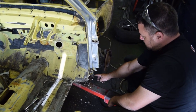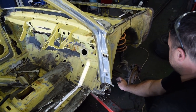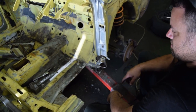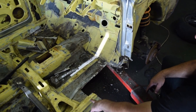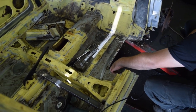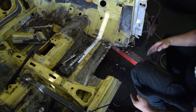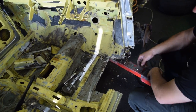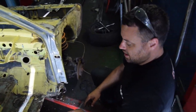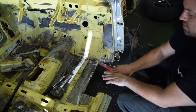This section around the curve must come off, and then obviously we've got the double paneling for the firewall slash foot area. Once that's cleaned off, this folds in under that one. The step's been cut on this side and cut from the other — we just need to step this one. I'll take the outside section off so we can do some spot welds up there, weld down the inside and on the outside, giving some side-to-side motion rather than relying on just a butt weld. For the floor I'll overlap it slightly so I won't try to butt weld it — I'll fold it over.